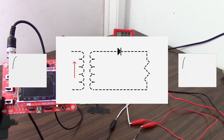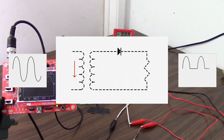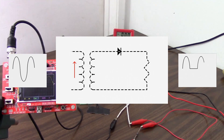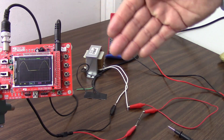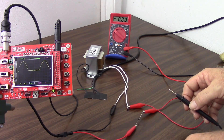So the voltage across the load during the second part of the cycle is going to be zero volts. As the voltage reverses polarity in the primary, we only get one polarity in the secondary. And here we see this cycle repeating over and over. So now we have DC, but it's a pulsating DC. That's okay for light bulbs or maybe motors, but not good for a lot of other electronics. Let's also take a look at this with the meter.